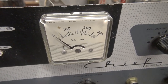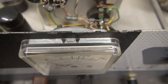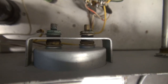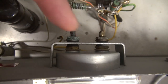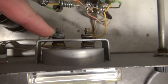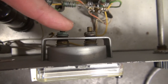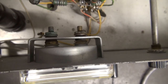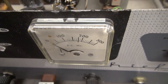Our mission is to change out this 0 to 300 milliamp meter with the new Westinghouse one. If you look behind, you'll see it is a round meter, and all that holds it is this little U-shaped bracket. The lugs that actually mount it are also the lugs that the signal goes through to deflect the meter. So it's going to be a fairly simple process — I'm just going to remove the bracket, pull the meter out, re-drill, and put the new meter in.